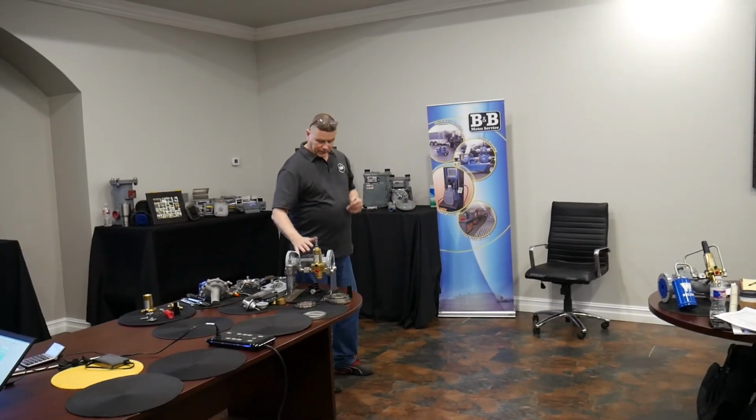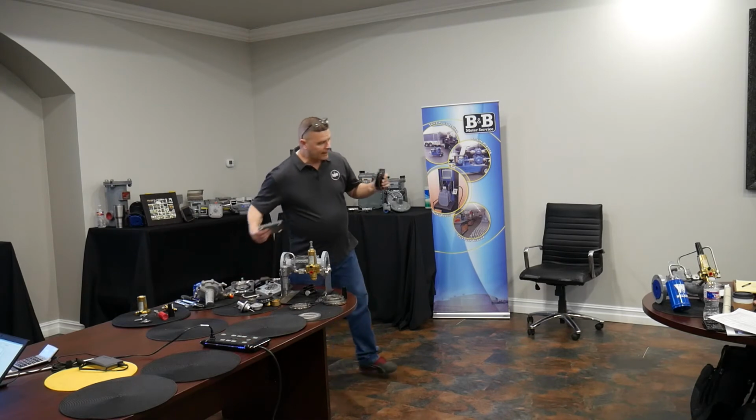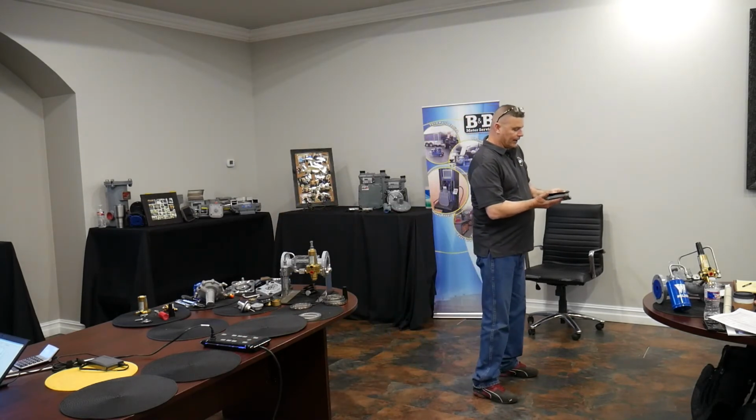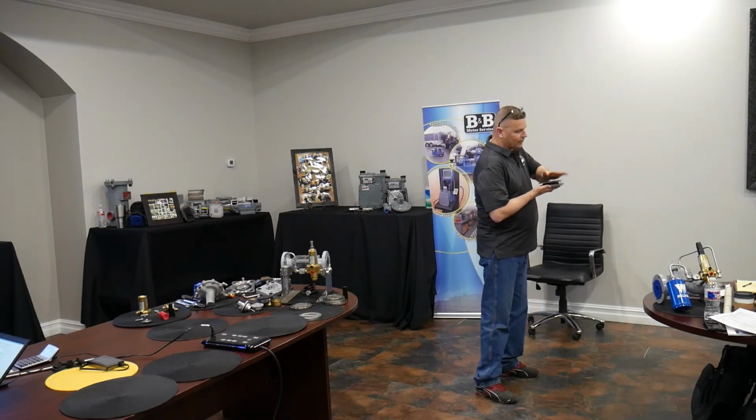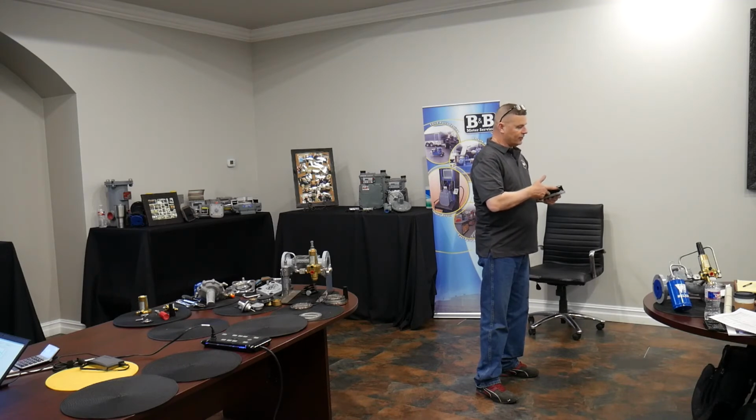The other problem could be that I don't have a good seal anymore because of wear on my diaphragm on the downstream side or whatever, and no matter how much, 200 pounds, the pilot puts here, it's doing a good job of putting that pressure there, it's physically got debris or some other thing that's not letting it seal off, and it's leaking through anyway, okay?